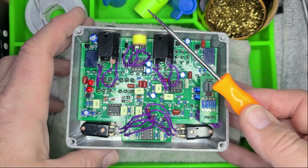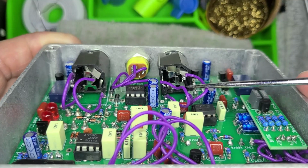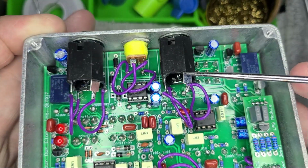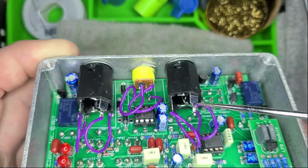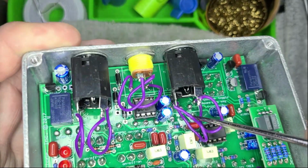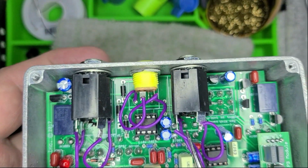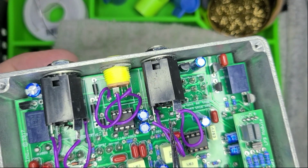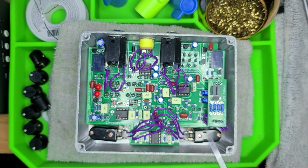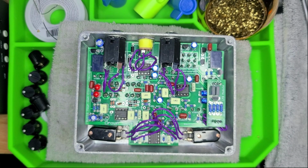What ended up being the case was on these specific lugs, you'll see this little tab back here now. This guy right there that comes up and has that little hole, that used to be flat like this on both of these. And the problem is that guy right there was touching that solder joint. These two right here, 1 and 2. And I believe what was happening was it was just completing the circuit, but not allowing all of this circuitry to actually work. That's the best assumption I can have, or that I came up with.